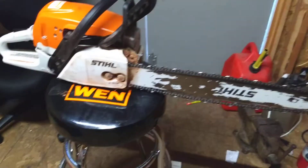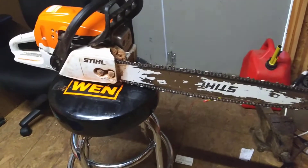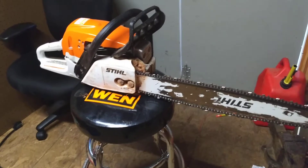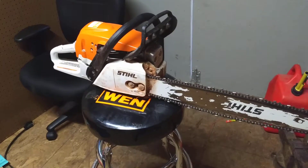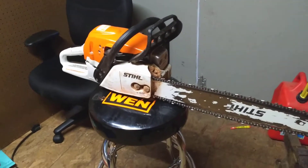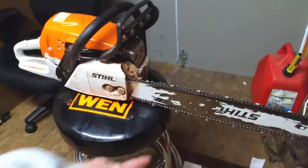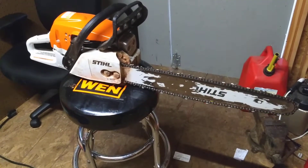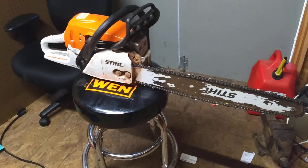The other thing I found out — this is a 20-inch blade, but you can also get it with an 18-inch blade. Some people get that because you're not pulling as much and your chainsaw will run better with a shorter blade. But up here we've got pretty good-sized logs. On a bigger chainsaw you can also get a skip-tooth chain, which skips a tooth every so often so you've got less drag, it'll run quicker at higher RPMs. I can't find a skip-tooth chain for this size, so I just run the regular.